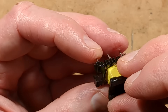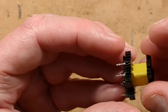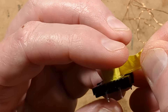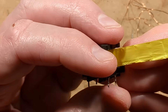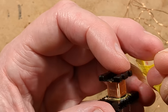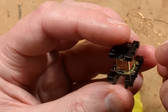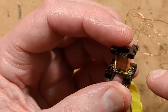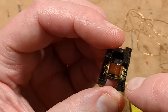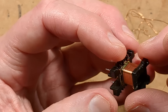This is another product where they've skimped in the most stupid places. They could have made this a completely safe product but they've violated the electrical separation in two ways: the secondary winding is too close to the primary wire, and there's the ridiculously cheap fake class Y capacitor. If they'd wound the secondary a bit further in, used double-insulated wire, or added sleeving, and fitted a proper class Y capacitor, it would have been fine. It gets annoying when they do stuff like that.